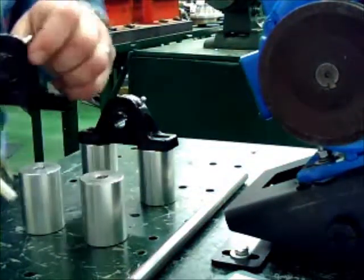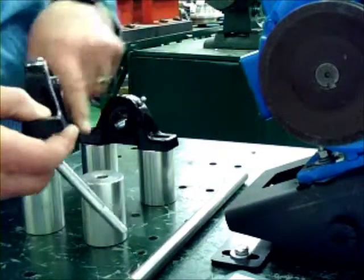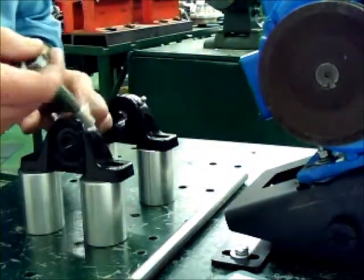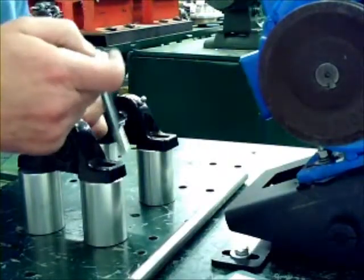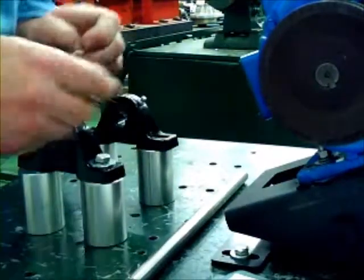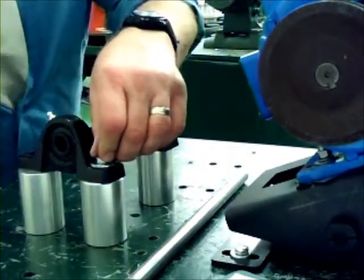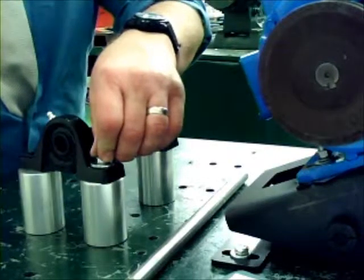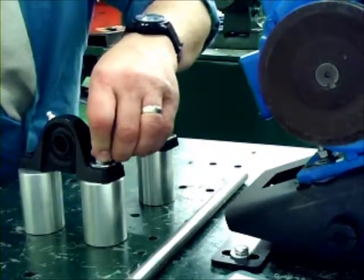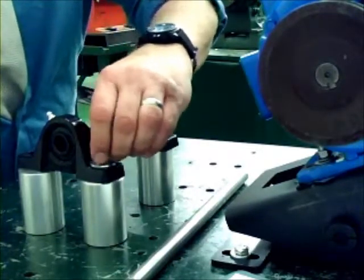Now, of course, the step is to line up your pillow block. Your bearing goes on top, and remember, the clamp ends go facing towards each other. So the clamp ends always go facing towards where my hand is. We drop these down from above. This is a 4-inch, 3/8-inch screw, and I'd go hand tighten: flat washer, head underneath the table, be flat washer first, then lock washer, then finally hex head nut, and I would say about almost finger tight.